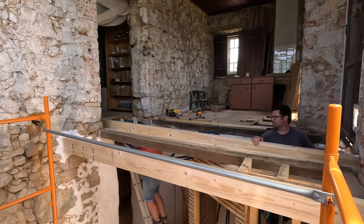We're hoping it's going to sit on the wall plate. Yeah. Without any notching. So you see this? Yeah, the spirit level's at the top, which means it's 7 centimetres out. And it's not on the wall plate over here. It's also out by 3.5. So you might have to notch 3.5 on that end, bottom there. Yeah. And then it'll sit nicely. That's the plan. In which case, we're also going to have to notch it across this wall. Yeah. That's fine. I mean, we're not taking the wall down.